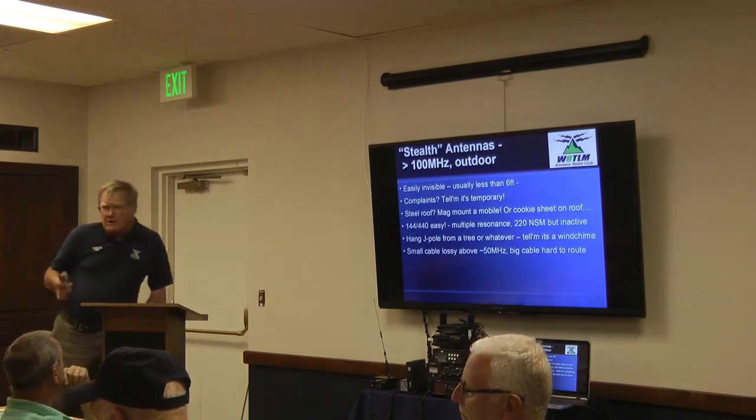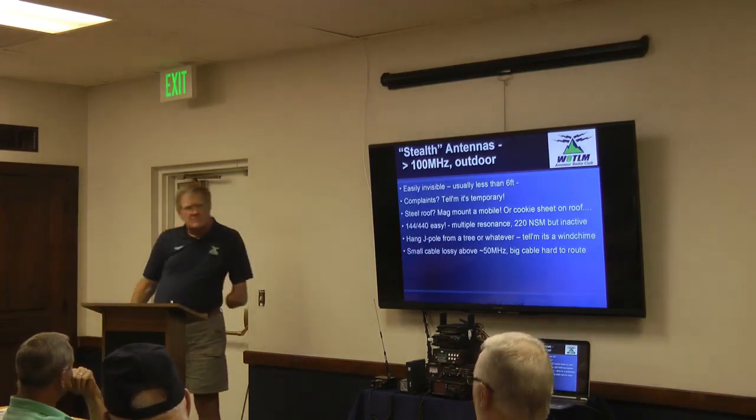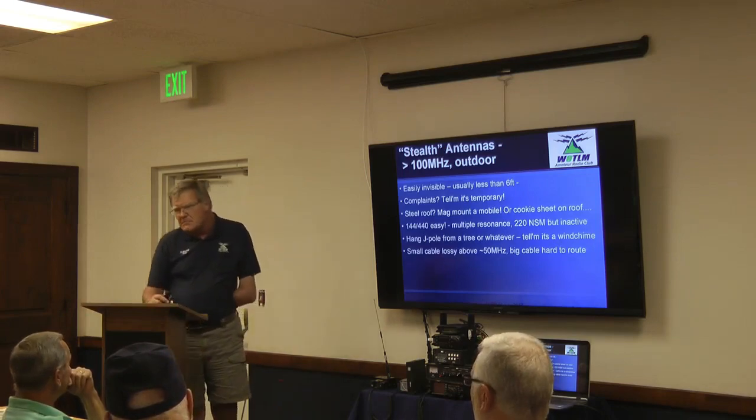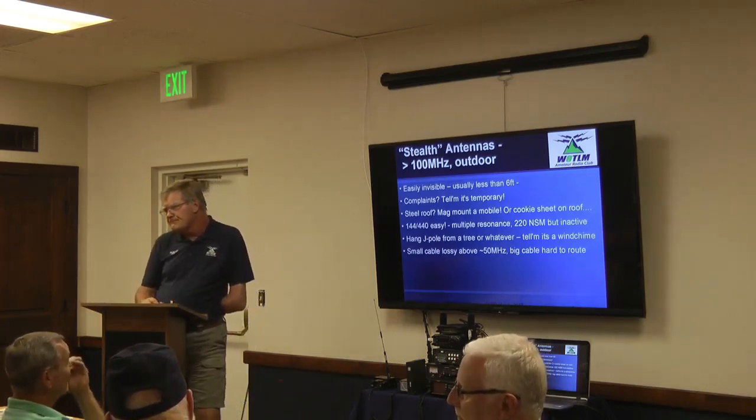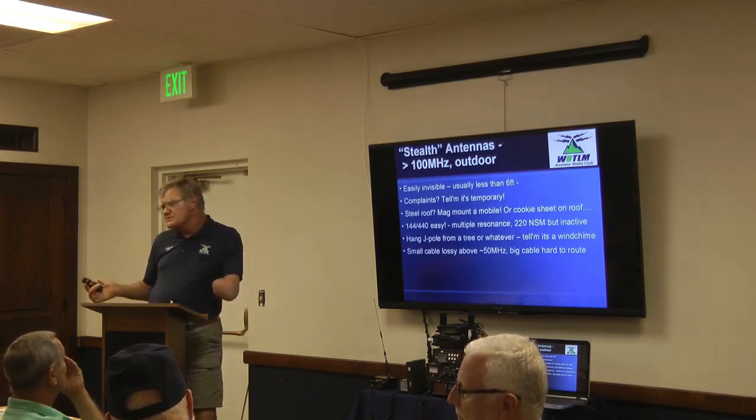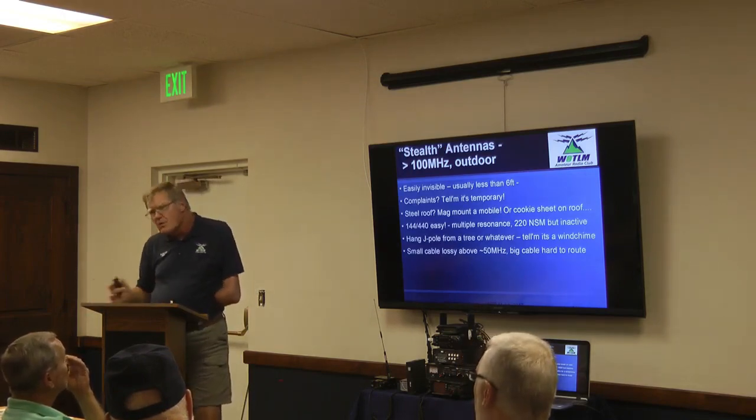Be very aware that small cable is very lossy, above 50 or 100 megahertz. So think about that. Doesn't mean you can't use it, get away with it. Just be aware that it's lossy.